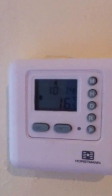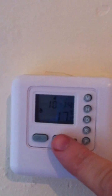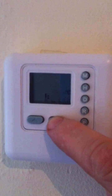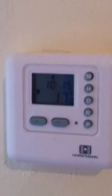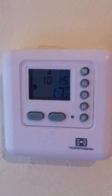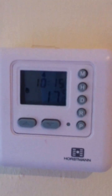Once you've set all that, just press R and it's basically working. You've got the temperature — it's 17 degrees now, getting a bit warmer. These are the override buttons. If you want to give it an extra boost, you push one of these buttons — up or down — wait until it flashes, and then drop it up or down to whatever temperature you want. Now on the left hand side of the display there's a flame. If that flame is there, you know the boiler's calling for heat. In a couple of seconds you should hear the programmer make a little clicking noise.